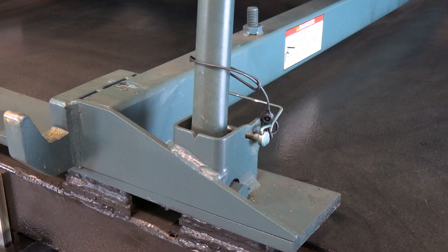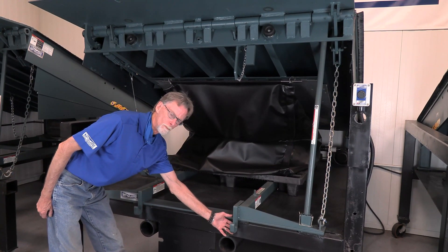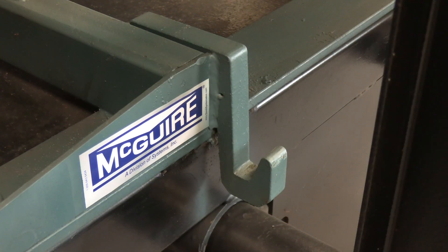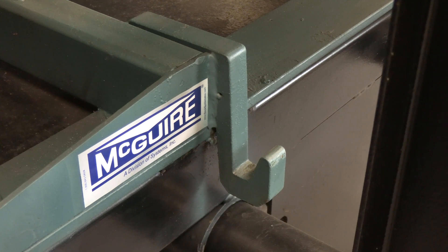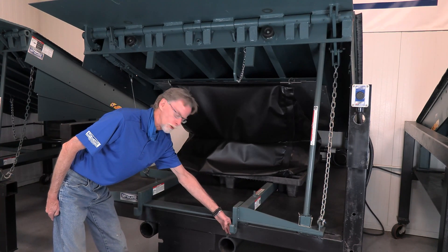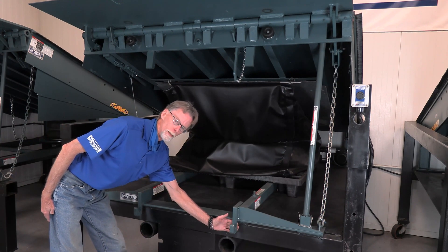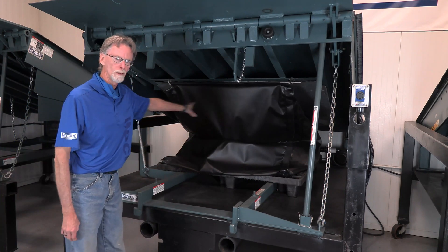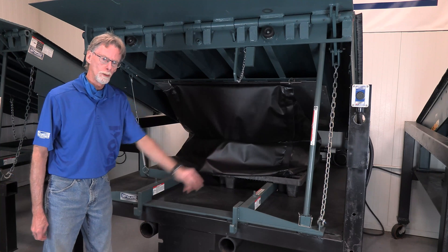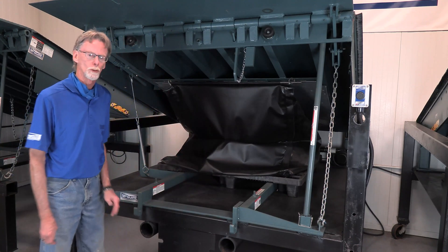You don't necessarily have to do anything out in this area unless you want to do it for aesthetics. You still need to shim underneath your lip keepers on both sides, and underneath the maintenance prop area. The area that I'm pointing to is actually the lip keeper. This lip keeper is a little bit different than what we saw in the hydraulic — this is an 18 or 20 inch lip style keeper. In this instance, you're going to need to put a shim behind that lip keeper to the curb steel. We do that so when the lip is in the keepers and a forktruck runs over it, you don't tend to bend the lip keeper back towards the building wall — because if it bends back too much, your lip may not seat in the keepers again. So it's pretty important if you have an 18 or 20 inch lip to put a shim in behind the lip keeper area. Other than that, the back shimming is identical, the top welding of the curb steel to the frame is identical, and the front still has the lip keepers and the maintenance prop area.